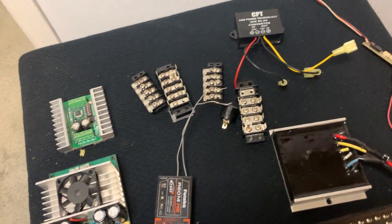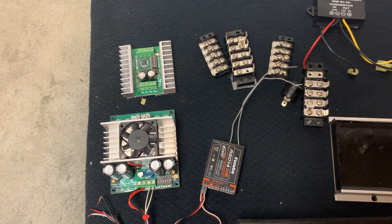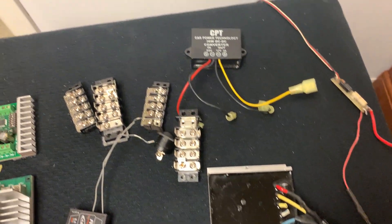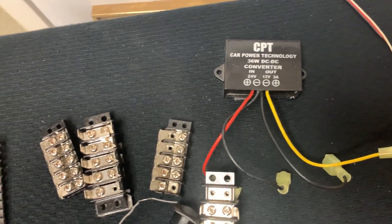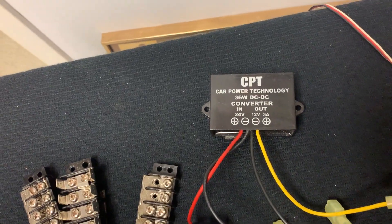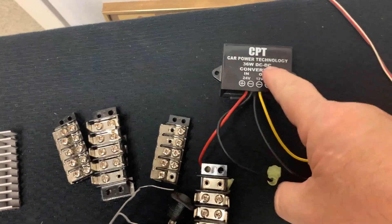That's how one of these things is put together. It's not rocket science, but it does get a little involved. There are a lot of guys online making remote control lawnmowers and snowplows using the same components. The big thing is you want to run your remote control snowplow off 24 volts. If you build a remote control lawnmower you can run it off 12 volts, but 24 volts works better even for lawnmowers.